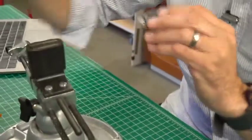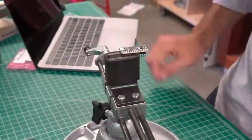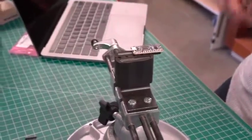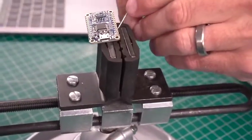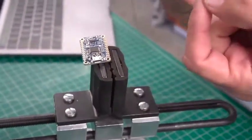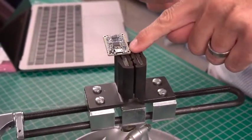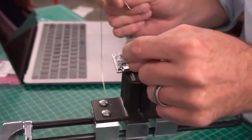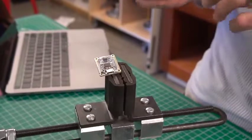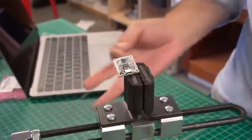I want to demonstrate that. You will see we get the soldering iron set to 750 degrees because we are using non-lead solder — it has got to be hot. I am going to put on my safety goggles. When dealing with circuitry, we want these little rings to get hot enough to melt the solder, but if we hold the iron on there too long, we can fry the board. So we have to be smarter, faster, and more precise — only hold it on there for two seconds max. Otherwise you start distributing heat into these really sensitive components.